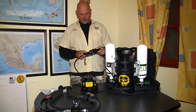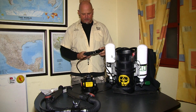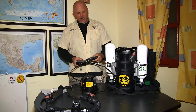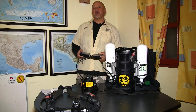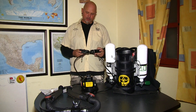I've changed to a manual set point so the solenoid does not try to inject oxygen. I don't really have to calibrate them because the sensors are so great, but I'm going to do that anyway. I think it's good practice and good procedure to calibrate your oxygen sensors at the beginning of every diving day.